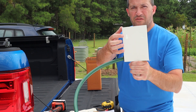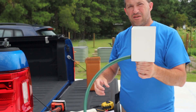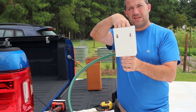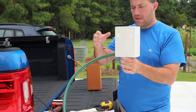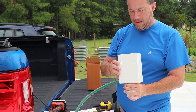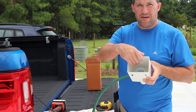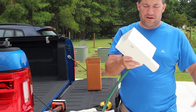There are holes to mount it to your house, so I'll be doing that as well. Because this is metal, it's a little heavy. Where you cut your pipe, the top half comes in here, the bottom half will go right up against here, and this tube will go into your rain barrel. When the water fills as it comes down, it's supposed to fill up the box and then rainwater will go down into the barrel. If it starts to overflow, it will go into the tube and down the rest of the downspout.